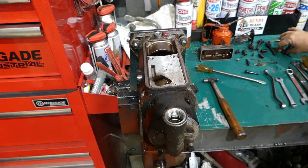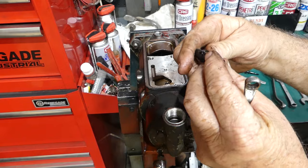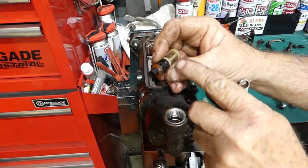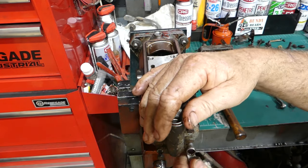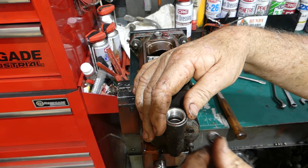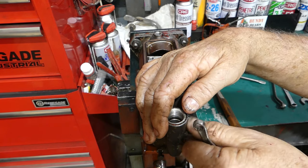This end piece on the washable filter — there's a little shuttle in there that must move freely under its own weight. It's stuck down the hole with a little spring at the bottom, so when we get it off we hold it over the bench before tipping it upside down.